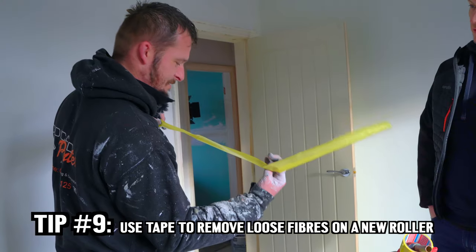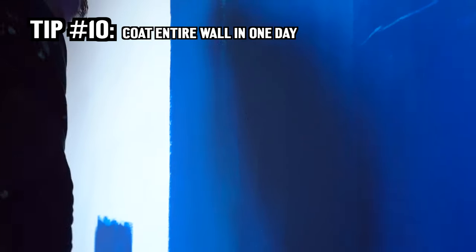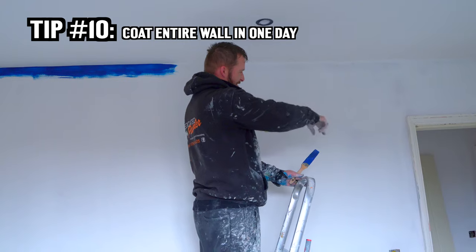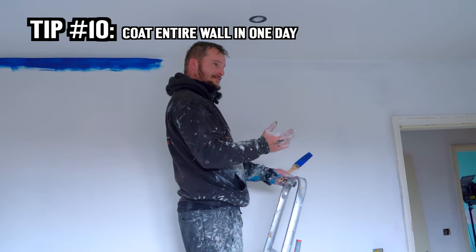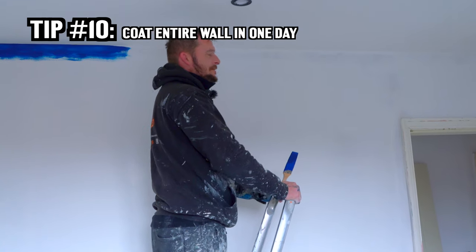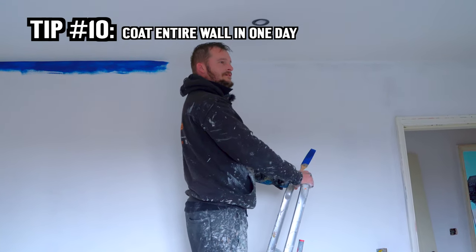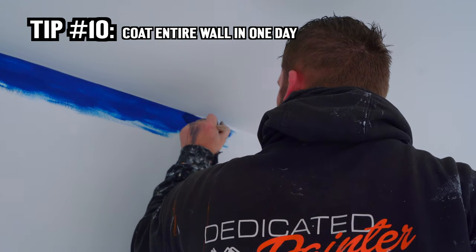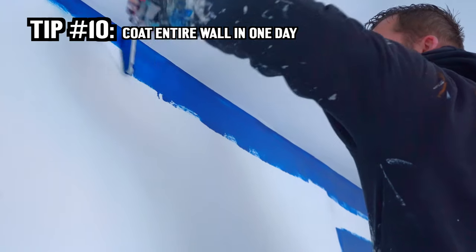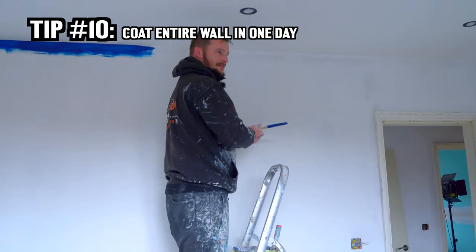Could you cut in and paint the wall on two separate days? On your first coat, not your second — if you cut in, left it a few days and then rolled, you'd see the difference. It's called window framing, where you can see your outer edges. But I always roll with my mini roller once I've brushed, which gets rid of any brush lines. Then when you roll with your big roller, it all matches and blends out.